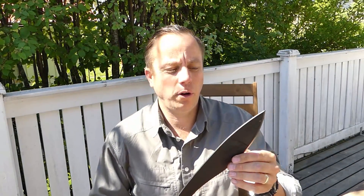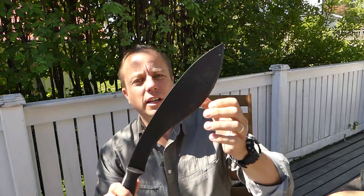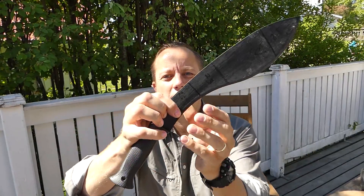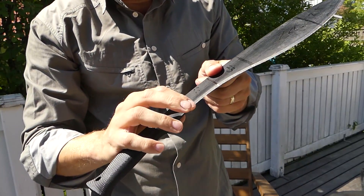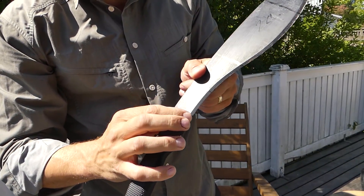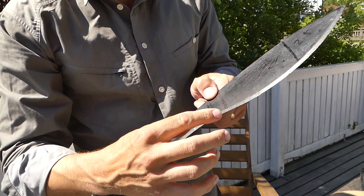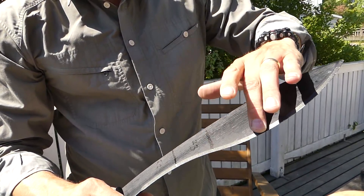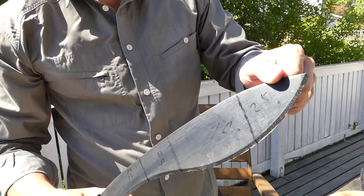Just wanted to have a little discussion of my kukri there before I get to work on this. We'll hit it with the files and then start the sharpening process. I'm going to sharpen it in sections so it changes its grind as it goes down. From the close-up portion near the handle where you might be doing fine carving or slicing, I'm going to do 22 degrees. Then 23 degrees as the belly starts to transition in. Then on the belly portion it goes to 24, and right at the tip I'll make it 25 degrees.